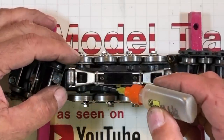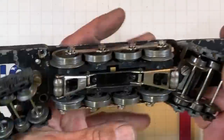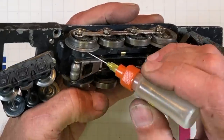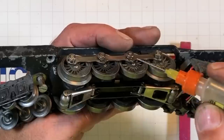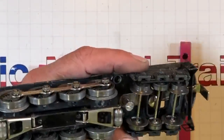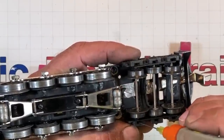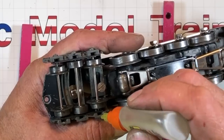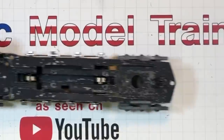Since we're here, I'm just going to oil everything, just a little bit. These rollers need some love. Come in from this other side, let it drip down in there. These axles need some love. I'm going to push them up a little bit and give each axle a drink. I'm doing this at an angle so the oil will roll down into the bushing. See how it's all quiet now? Quieting it right down. These guys want oil too, and they've actually got these little bosses where the oil goes — super easy to oil the trucks.